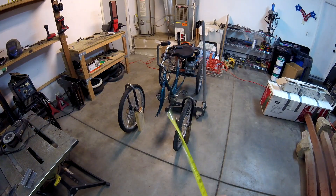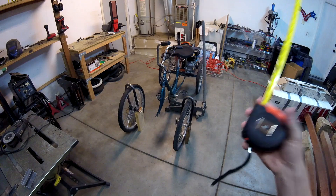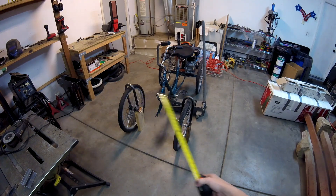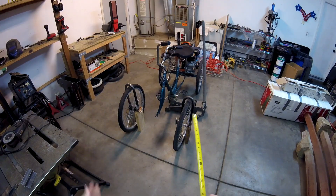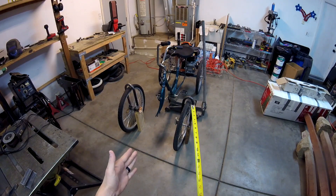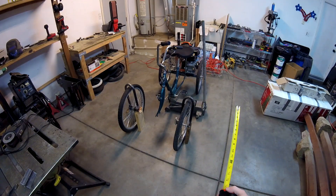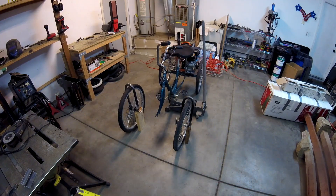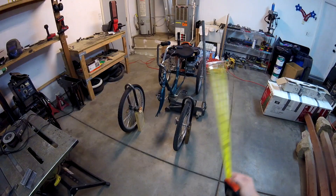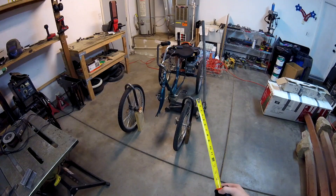I'm having a little bit of a dilemma here. The back wheels are 26 inches apart. I'm thinking about aligning the front wheels with the back wheels, just making it 26 inches. I don't want the front wheels to be super narrow, because the more narrow it is, the more topsy-turvy it becomes. However, if it's narrow, you can fit in a lot of places, like bike paths or sidewalks. That's one advantage for having such a narrow wheelbase.